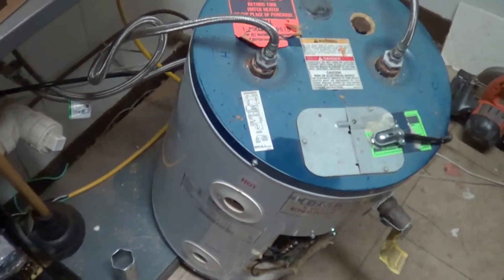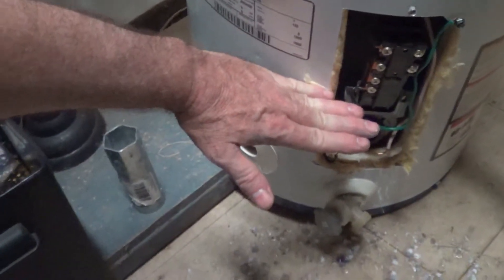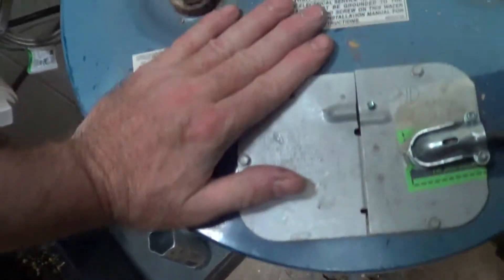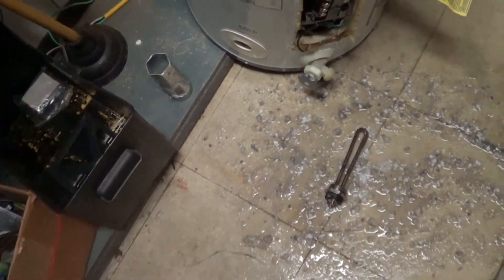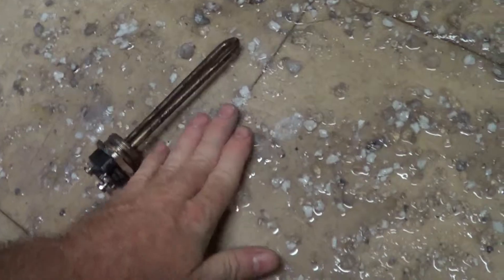Anyway, that's a 12-gallon hot water heater. It drained out about two-thirds of the way, then I pulled the element out. With the heater horizontal, the water was probably 40% full — that glugged out, then I flipped it on its side and all this crap was in the bottom. This unit has been installed for about five years but only actually used for a few years intermittently — which is probably a bad condition. I never replaced the anode, and that may be contributing. It's amazing the amount of crap that came out. If you're drinking from your hot water heater, you may wonder what's in there.